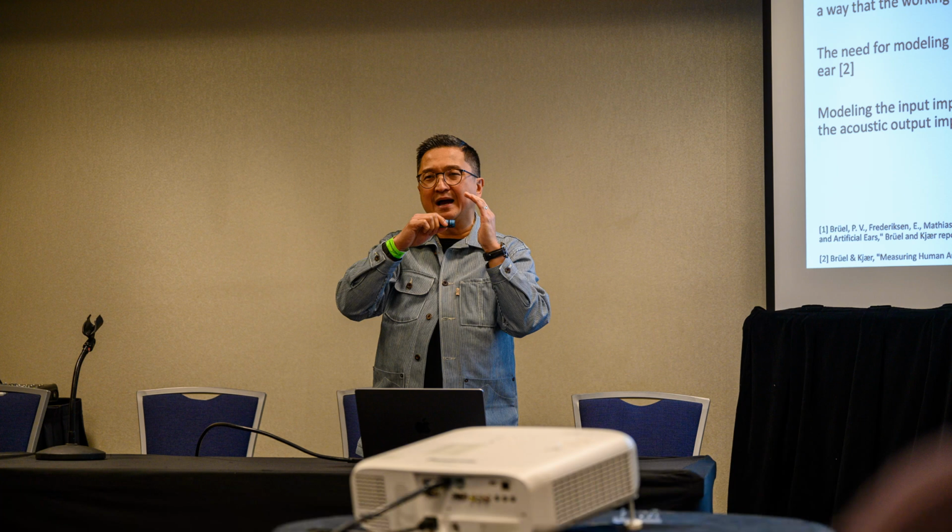So we all seem to understand the idea that there is a transformation of the sound field from out here to the drum. I think we can pretty much get that. But what a lot of us don't understand, and I certainly didn't when I first started looking into measurements, was the fact that in just coupling something to us, we're also affecting the behavior of that driver. And if, when you're doing the measurement, you don't affect the driver in the way it's affected on you, then you're not going to get a human-like measurement. So yes, there's a transformation of the sound field, but there's also the effect on the driver.